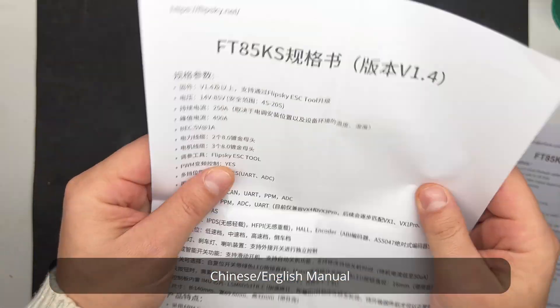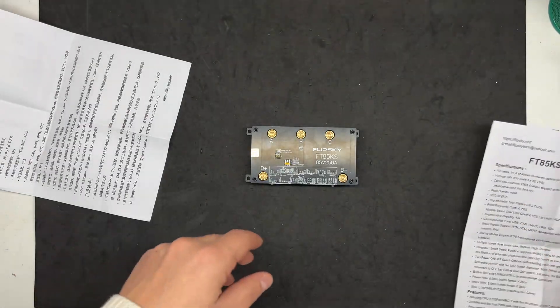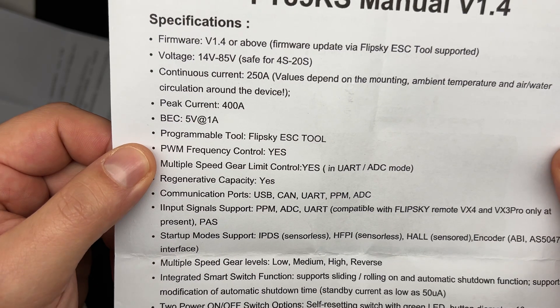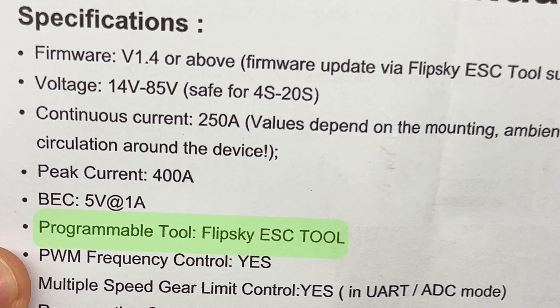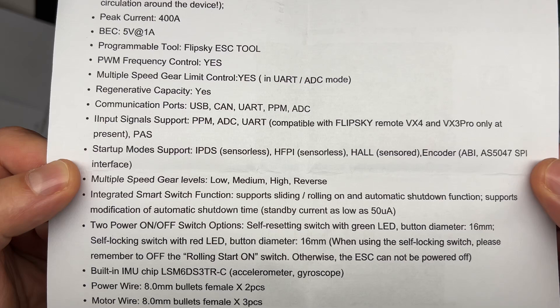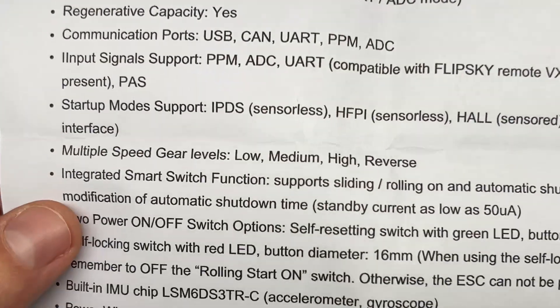Also the manual — just kidding, guys, I barely can speak English so better stick with that one. Now this bad boy can run on 20S battery, 250 amps continuous, with a crazy 400A peak. Keep in mind this is a non-VESC series, so you have to program it with the FlipSky tool on its 1.4 firmware, which also supports field weakening. Another cool feature is that as input you can choose the CAN bus as well.